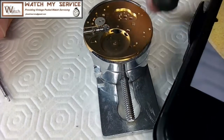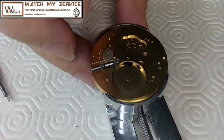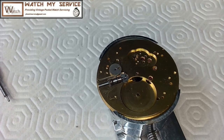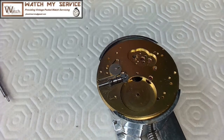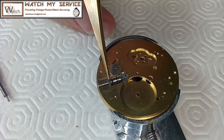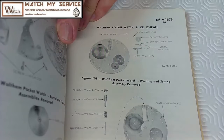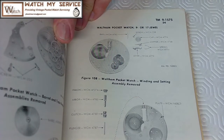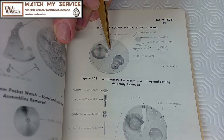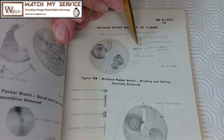So that's the keyless mechanism. I think I'm going to get a book out and see if I can find anything on this. There it is — that is the assembling of the keyless works, and I'm going to stop and publish. Just to be dead accurate — I was right. This is the clutch wheel, and this is simply called the pinion. So clutch and pinion. I found it — here as you can see, these are what I was putting in place, and there's that spring.